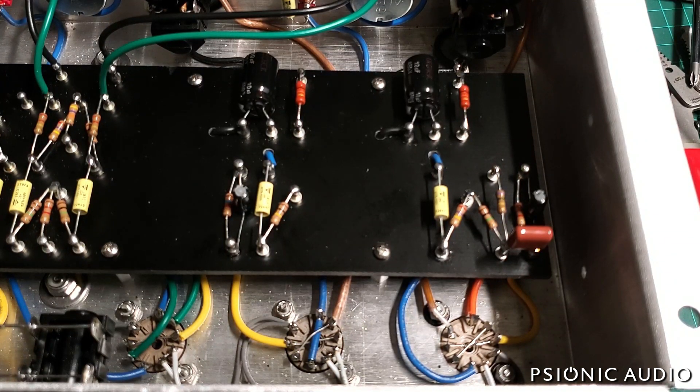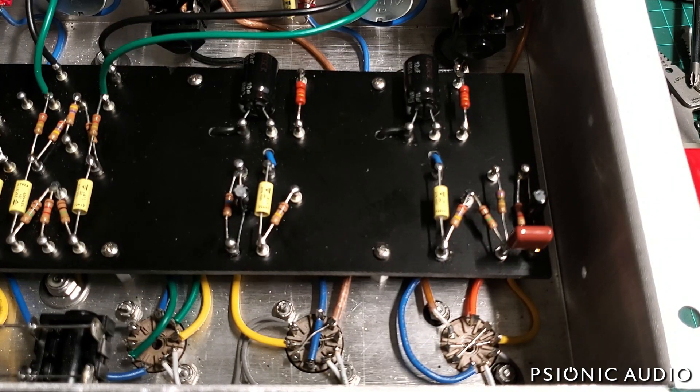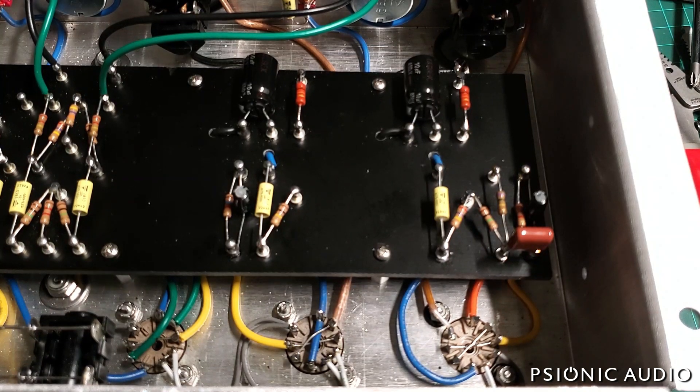I suspect that the Tungsram is the more accurate as things go. The only way to find this out is to call my buddies at Tube Depot and see if I can borrow two or three other new old stock tubes to really get this fine-tuned. This might be one of the reasons people say — usually quite rightly — that Electroharmonix current production tubes don't sound as good in an EF-86 amp as new old stock. It may not be a fault of the tube so much as that the voltage has changed dramatically — something a tech can look at, but to the owner you change tubes, you change the sound. It's possible that if the amp voltage were adjusted a little differently for the Electroharmonix, it would sound fantastic.